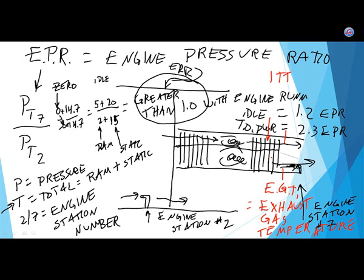So, go ahead. When you're trimming the engine, yes, you are trimming for the compressor's efficiency. That's one part of it. Literally, if you're going to fire up an engine, does it put out the power it's supposed to? Does it do it within all its parameters, in particular exhaust gas temperature?